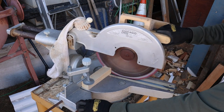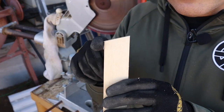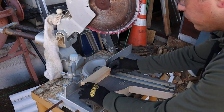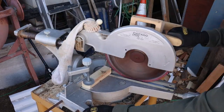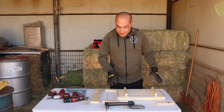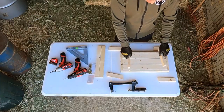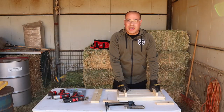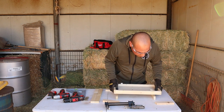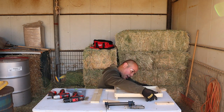On this cut you're going to want to do a 15-degree angle on both sides of the leg. Make sure you cut one side and then just turn it over one time clockwise and cut again. In order for the legs to be attached to your table or bench, we're going to put these supports across the bottom of your tabletop. I went ahead and marked it with a little piece of tape so I know where to put the screw through the bottom there.